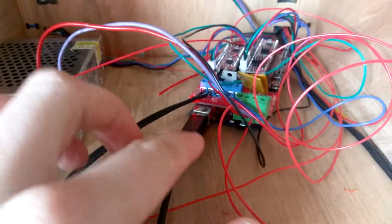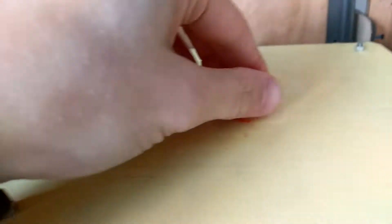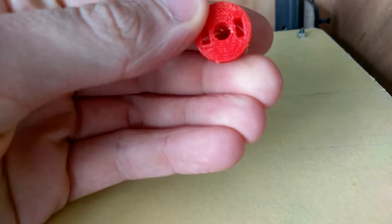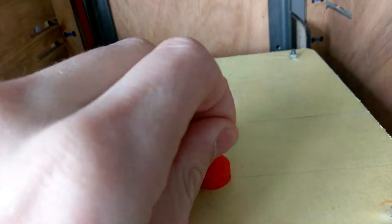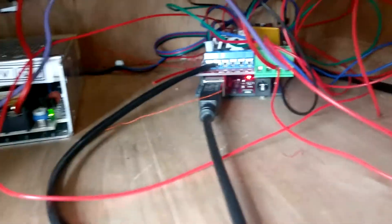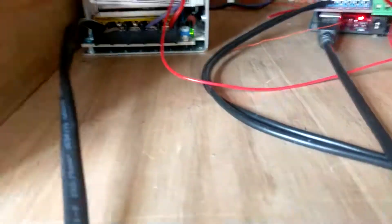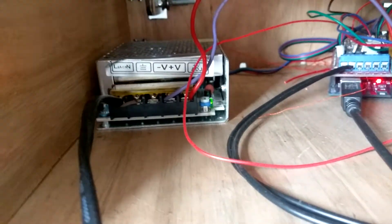The electronics: this is an Arduino Mega. That's the Z-axis moving down - as you can see, it's just finished that print. There's also a small gear you can attach to a 5mm shaft to give you a GT2 pulley. The electronics consist of an Arduino Mega with a RAMPS 1.4 board, bought off eBay because it's the cheapest option - there's no point making your own when it's already made in China for half the price. That's just a regular 12 volt, 5 amp power supply.